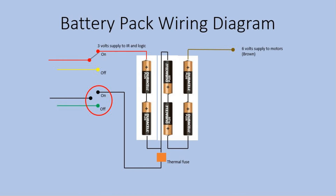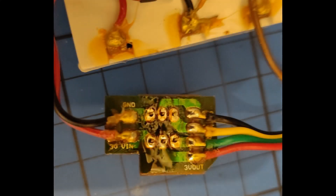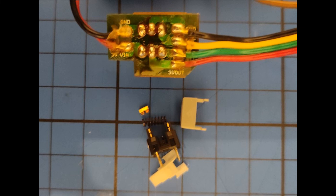I desoldered the switch using desoldering braid dipped in flux, which works a treat, and then replaced it with a spare switch I had. Did I need to buy the second raptor? Not really, but it was useful — the tip of the tail on the original was broken, so I was able to replace it with one from the donor. I'll also get a spare battery pack and have a look in future at rigging this thing to run off a LiPo battery. Thanks for watching and keep an eye out for the LiPo hack in the future!